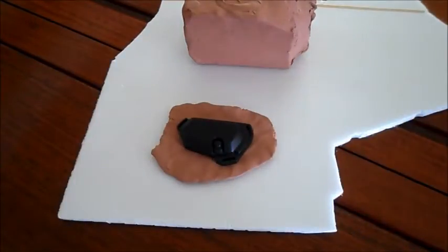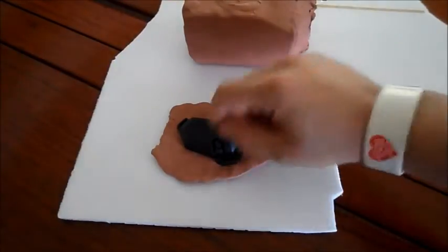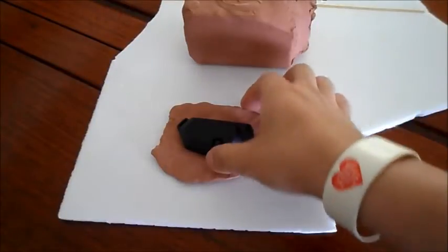One thing to note is when you're molding something, you want to make sure the surface is exactly as you want it. It should have exactly the right texture you want, be exactly as smooth as you want, whatever. You have to make sure you've got it exactly right, because silicone produces almost perfect detail. So if you have a tiny surface scratch, it'll show up.